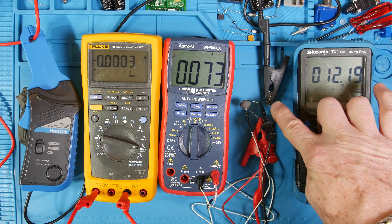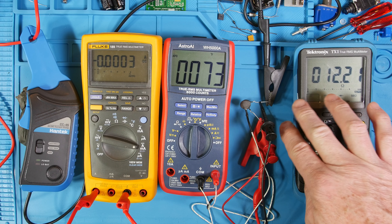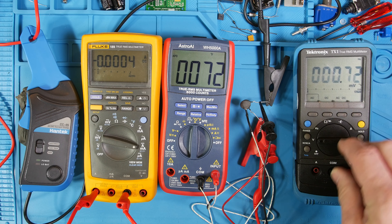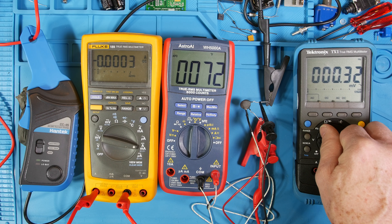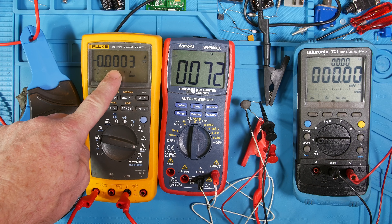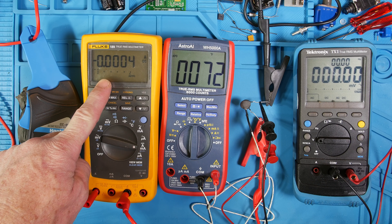Then this will quickly heat up and the resistance will drop. We won't be able to see resistance when voltage is across there, so we're going to switch this to voltage. And then when I turn off the power supply, I'll quickly turn this back to ohms so we can see the ohms. And when I flip the switch, I'll show you what it looks like on the scope — you can see it here on the meter.